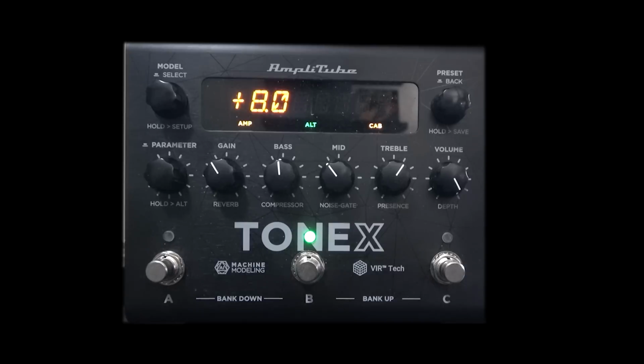So basically, in a nutshell, anybody who's used to plugging into an audio interface, such as a Focusrite Clarett, or plugging into an HX Stomp or a Line 6 Helix, we would just want to leave this input trim now at 0. That's going to be kind of equivalent to the old -9 or -10 setting. Leave it at 0. Off you go.